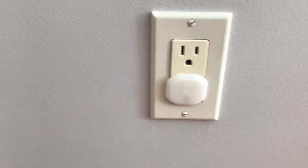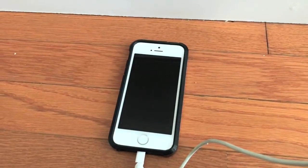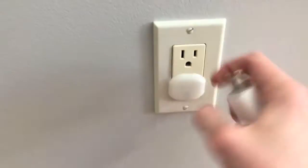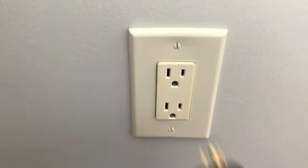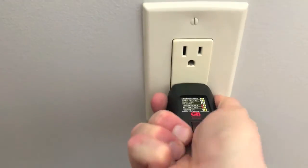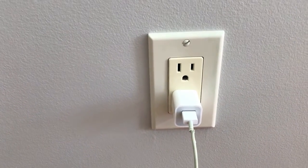Back at the outlet, let's plug in the phone — no charge. Just to be safe, unplug it, plug it back in — no charge. I'm even going to test the lower outlet — no charge. After that, I test it with the outlet tester and all lights are off. Power is confirmed cut. At this point we can say it is safe to begin.